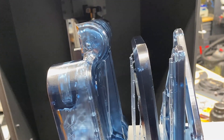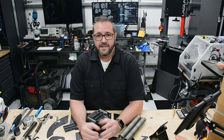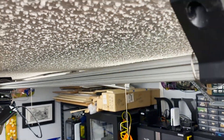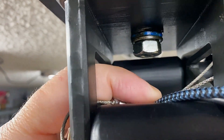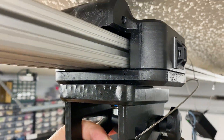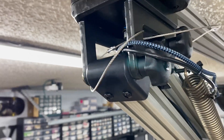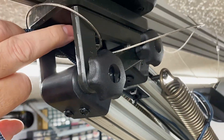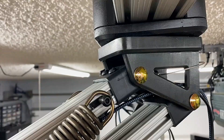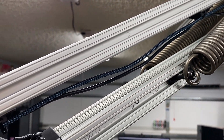For post-curing I cleaned the parts in 99% IPA, allowed them to fully dry, and then cured them for 20 minutes in my UV chamber. Assembly was easy and went together well. The rail was mounted on the ceiling with the base pre-installed. The arm was then mounted to the elevator bolt and thrust bearings, and once mounted the arm was installed on the base. I didn't get a lot of pictures of this because of the difficulty and weight of the parts. With this rig in the future I won't have that as an excuse, because it can move around and shoot pretty much any angle of my shop. With the arm mounted on the rail I added the tension springs to hold the arm at half compression, providing support and extension on demand. The tension of the springs can be adjusted by sliding the spring mount points on the arms.